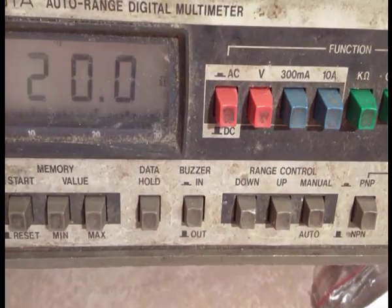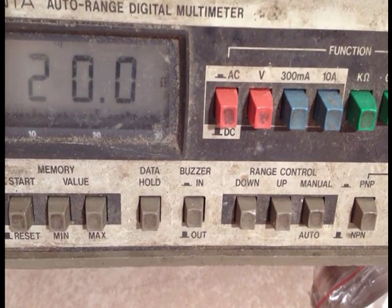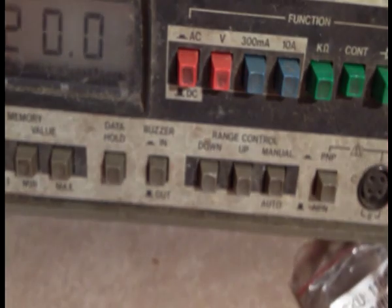So what I'm going to do is use the one for the RG58 section. Okay, much better. See now? Much tighter connector fit. Now, I didn't crimp this outermost ferrule down here. I'm going to do that too, because that'll help to secure the wire, because these wires can take a really bad pounding over the years.